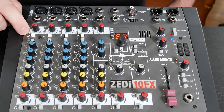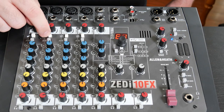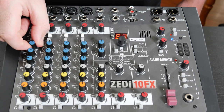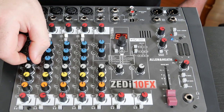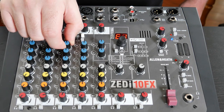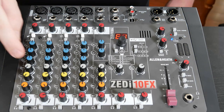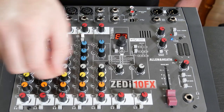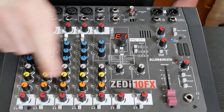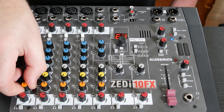I want to check these two sets of buttons — there's a line pad button and a low cut button on each channel, and I want to make sure these are all raised or disengaged. Then moving down, I have the EQ section. I want to turn all of my EQ knobs to center, 12 o'clock. There's a little indentation you'll feel when you get there that tells you where the zero position is. And then I have my aux and effects send knobs — I want to turn all of those down counterclockwise. Then my pan controls — I want to turn all these to the center, and again there's an indentation telling you where the zero position is.